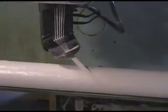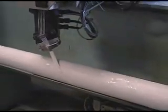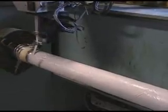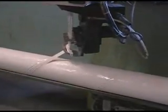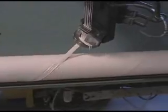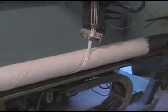This is also colored white. Here we are rolling a 2.5-inch tube on the steel mandrel using a 45-degree angle wind pattern. We have laid a veil mat layer down first to give us better properties in the marine environment. This is also colored white.